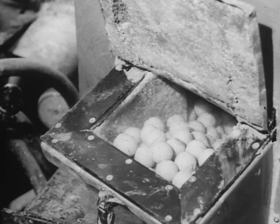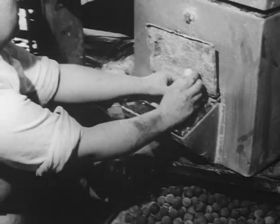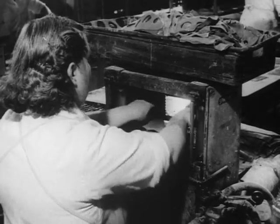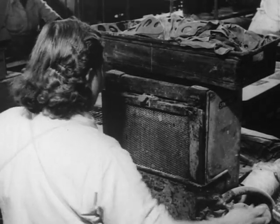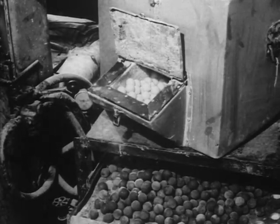The soft paste centers are frozen hard and, before they can thaw out and lose their shape, they are pressed between two sheets of raw rubber. In this way, each center receives a rubber skin which is then cured by a heat process.